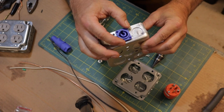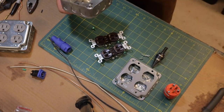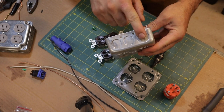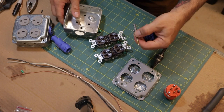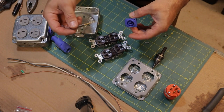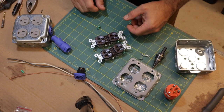I would rather just drill it out. This is another one of the same boxes that has half-inch and three-quarter knockouts in the center depending on which way you rotate it. You're going to have to take about an eighth-inch bit to drill these screw holes out. You've got two small number-four screws with lock washers, and that's it — that's all there is to it.